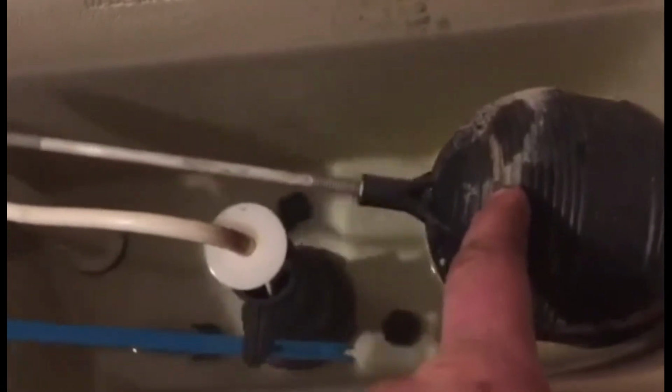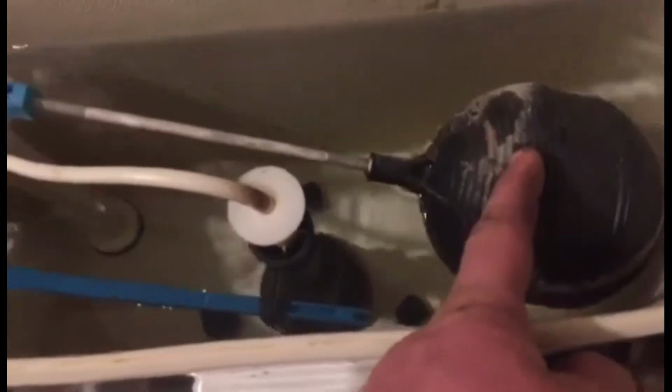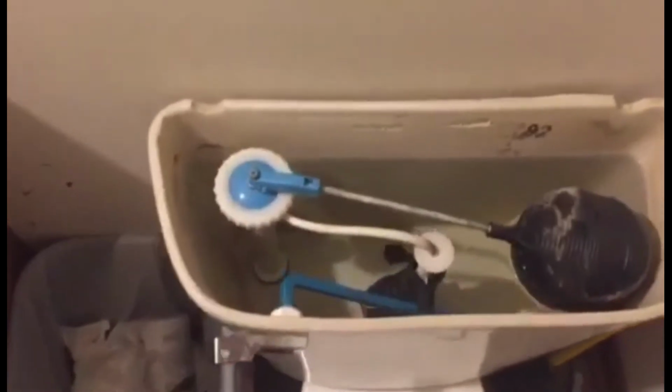You could call this your float. The float goes down, needs more fuel. Then when it gets enough fuel, it comes back up, if you get the idea. This float regulates how much fuel comes into the engine, or into the carburetor. Once the carburetor's full, it'll send it up like that, and no more fuel can come into the carburetor. So that's basically how this system works, and that's also how your carburetor works on your lawnmowers or snowmobiles or anything like that.